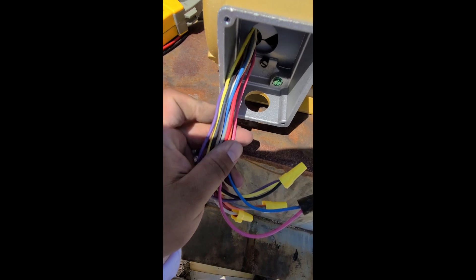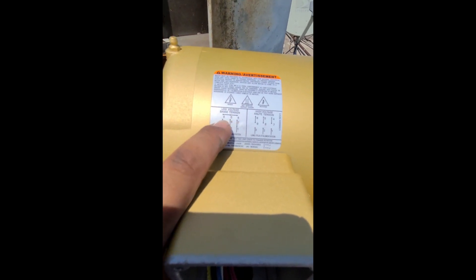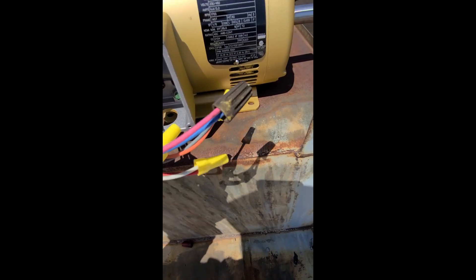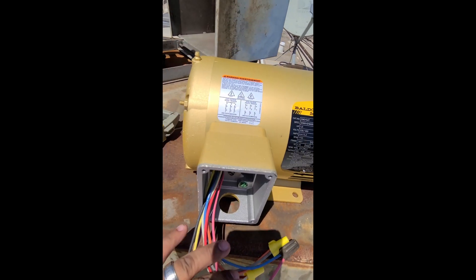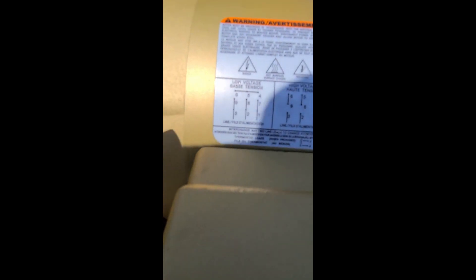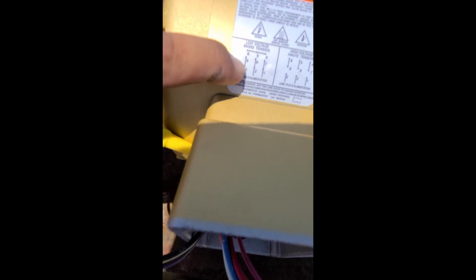You can piece that together and identify low voltage versus high voltage. The next step is to count the numbers of wires coming out — these are all numbered, and it just so happens to be nine. If you are using 230 you're going to have to tie wires four, five, and six together — those dots are connected. I've already done it with the three wires connected. Color coding doesn't really mean anything — don't go based on color; go by numbers. The wires four, five, and six are tied in. Looking at the low voltage side, the dots connect nine to three.